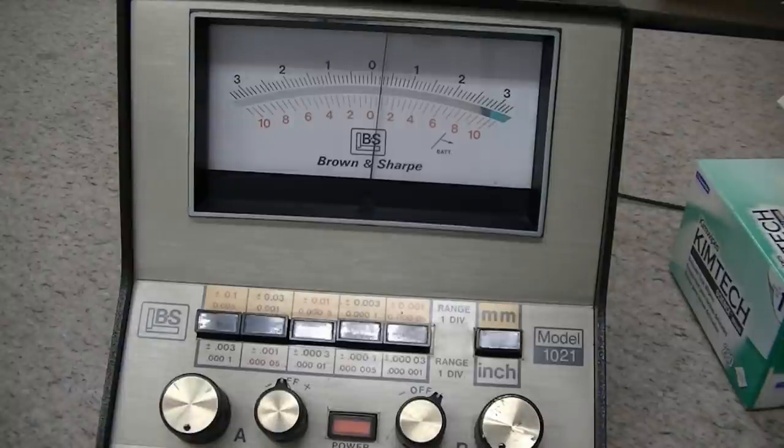To the end and it starts to drop off. So there's a little bit of shape in the plate, but we're within about 60, 70 millionths there, repeat reading, but that's nowhere near close enough to where we want to be.